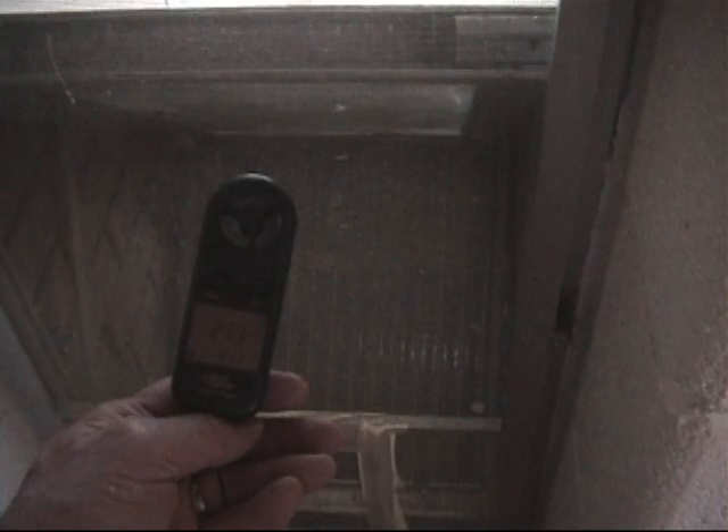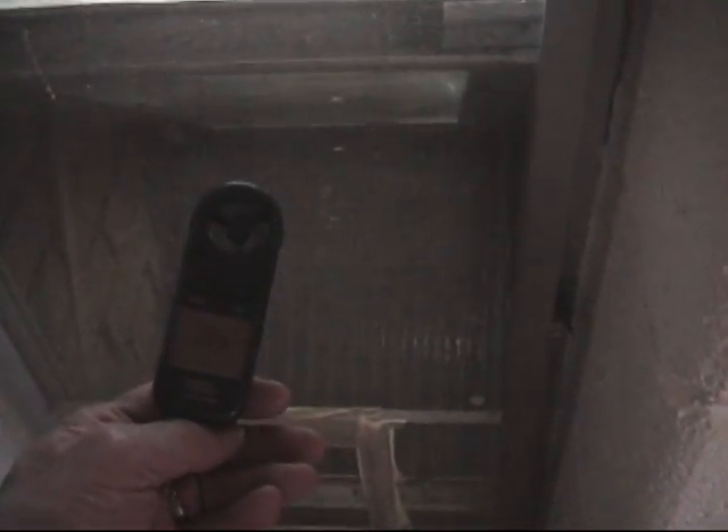The water's been running a short time. We're looking at a coil from the inside — this is actually the window open. It seals off between the bricks and the coil down below. We can get some measurement of airflow — in this case, air velocity in feet per minute. We can multiply that by the square feet of the coil, each coil being different, to get the cubic feet per minute through each coil and add them up to get the total cubic feet per minute. I'll show you a spreadsheet later.